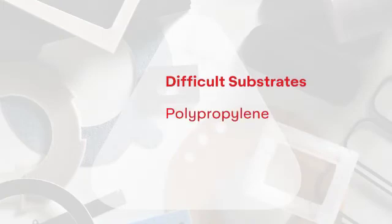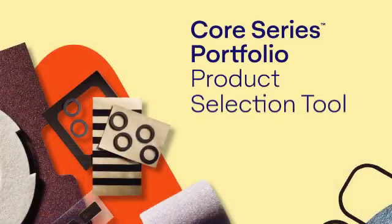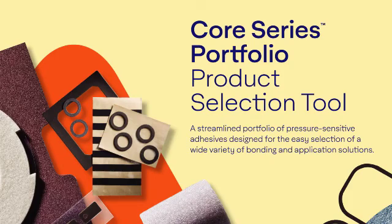The surface energy selection guide will help you identify the surface energy so you can select the adhesive for any application. Two of the most difficult substrates to bond to are also the most popular — low surface energy plastics known as polypropylene and polyethylene. Other difficult substrates include Teflon and silicone, which are considered extra low surface energy. The good news is that the Core Series portfolio has an adhesive for these substrates as well. And just a note: if you don't know the substrate, assume it's low surface energy. If your material is not listed in the product selection tool, please contact the application support line.